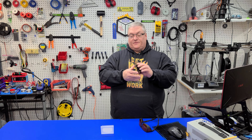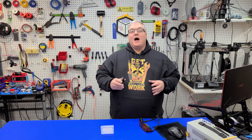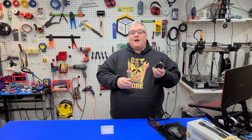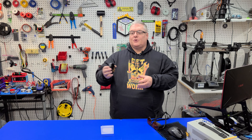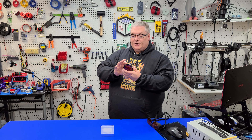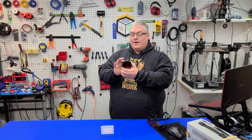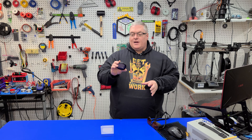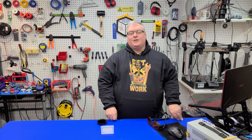As you can see, this filter really did a great job at reducing all of the light bleed and allowing us to get a much finer focal point on our laser than we did with our safety glasses alone. This filter is relatively inexpensive — I got it off Amazon for about $30. It's a specific filter for video cameras, one of the larger adjustable ones. You can go all the way from 530 nanometers, where it's slightly red and you can see through it, down to 750 nanometers, which makes it fairly opaque. But when the laser is on, you can still see the light from the focal point, giving us the ability to get it to a sharp point.